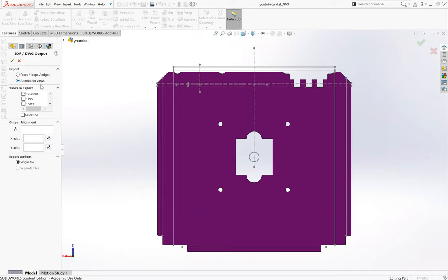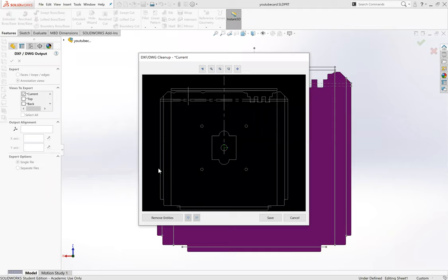Keep annotation views, select the view you want - I just make sure I'm aligned nicely and then I do current. That's what they'll see - it imports the dimensions over. It can also go both ways: they can send us a DXF and we can open it in SolidWorks. You can see the cutouts are there. I would also go in and add construction geometry showing where the hex nuts hit, so the electrical engineers know not to put any parts in that area because there's a fastener head or hex nut there.